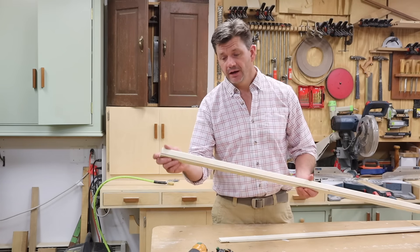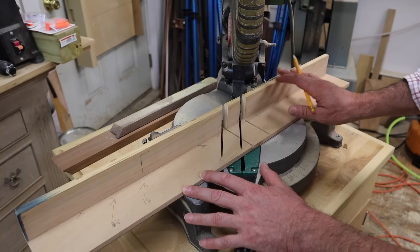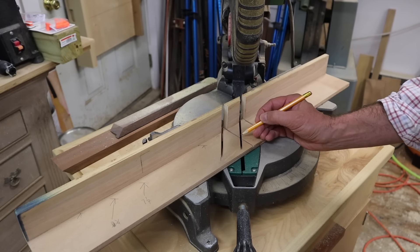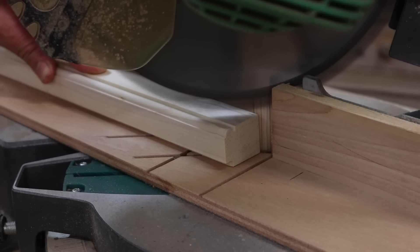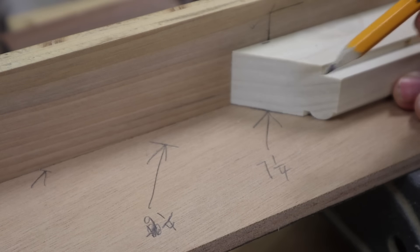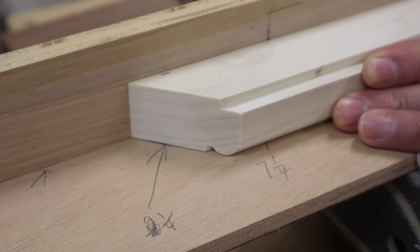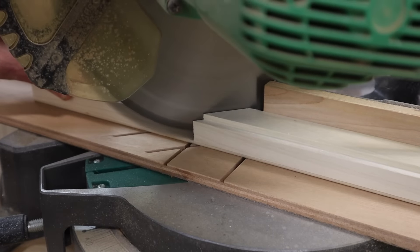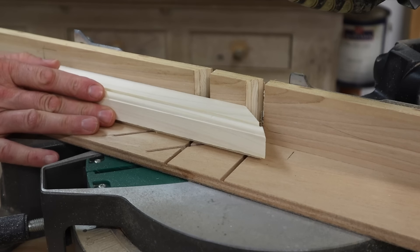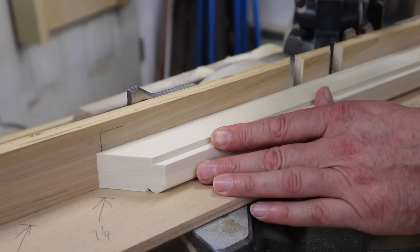Now that I've finished cutting the molding, I'll get to work on making the frames. A quick tip: this is called a sacrificial fence — I've got a video on my channel on how to make one. This makes making frames very easy because you can line your pencil mark up with the saw kerf cut into the sacrificial fence. Since both frames are the exact same size, I've made a mark at seven and a quarter for the short molding and nine and a quarter for the long molding, and I'll make four cuts at each length. After cutting the molding, I take the cut-off, flip it over, cut a new miter on it, flip it over again, and hold it at the mark.